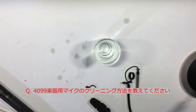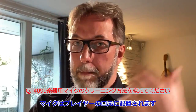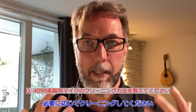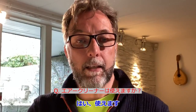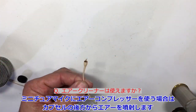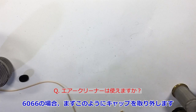If you're using mics on a violin player, you're relatively close to the player's mouth, and if they sneeze or cough you'll want to clean those mics. Marius is asking: can I clean it using compressed air? Yes, but don't blow the air straight at large diaphragm microphones. You can clean by blowing air from the rear.